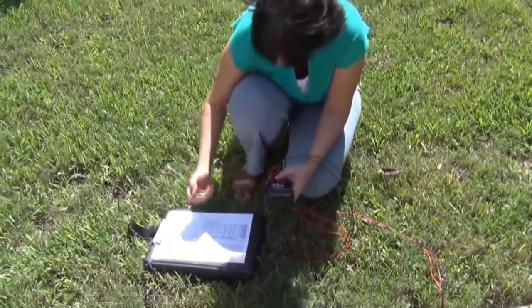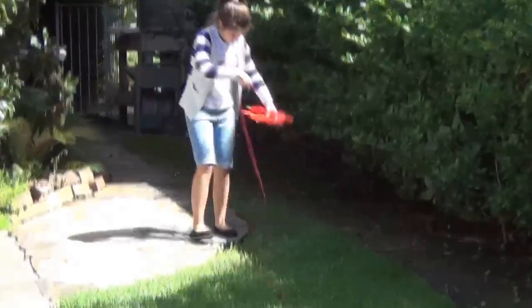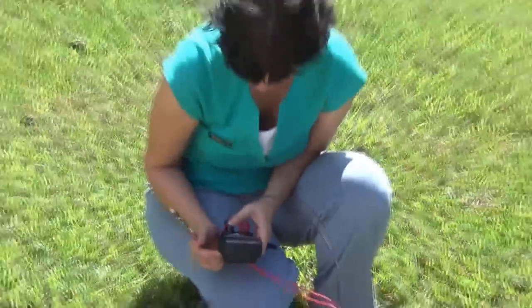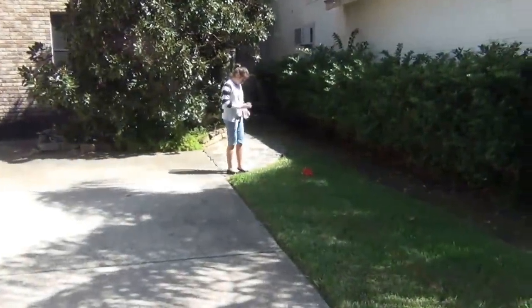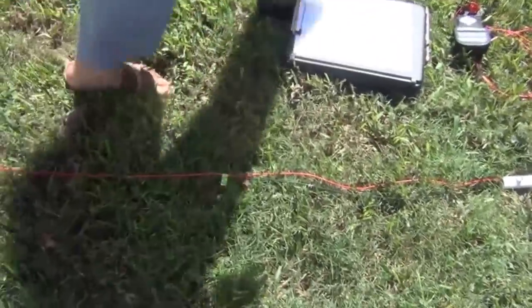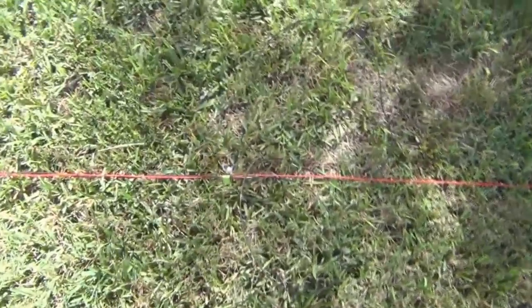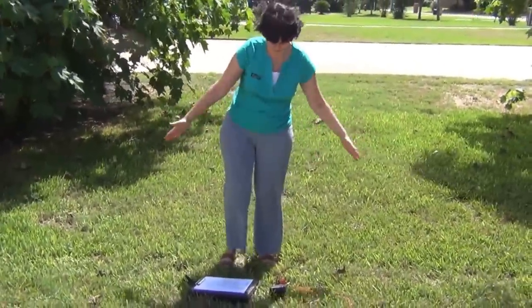12. 10. Next, 9 — now we have 1 meter. 8. And now since they're coming closer, we can also move those electrodes to the 1 meter mark. This just helps to boost the signal when they're close. Also in different situations and different soils, if 3 meter doesn't work, you can move it to 1 meter — and the other way around.